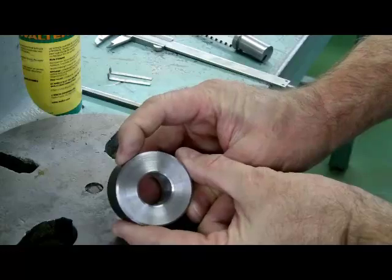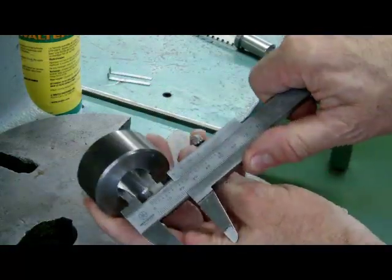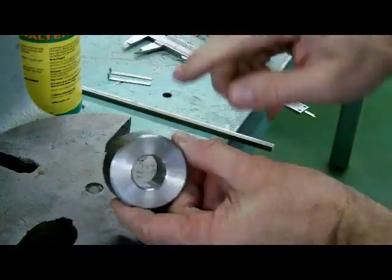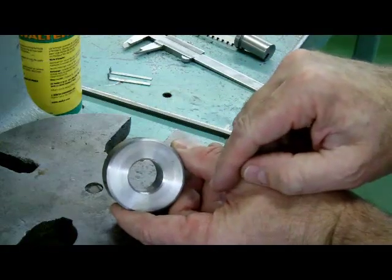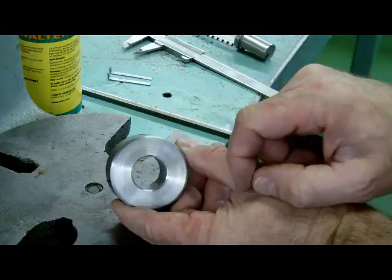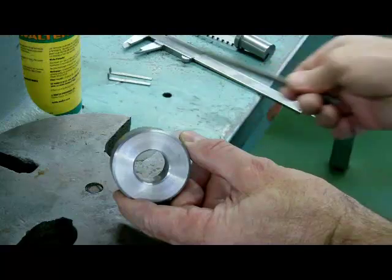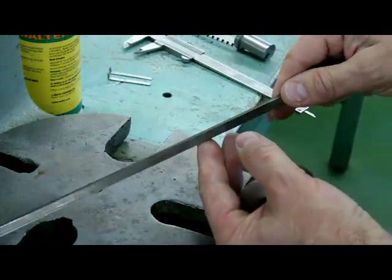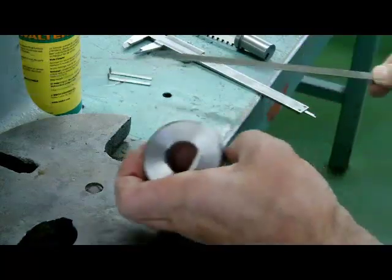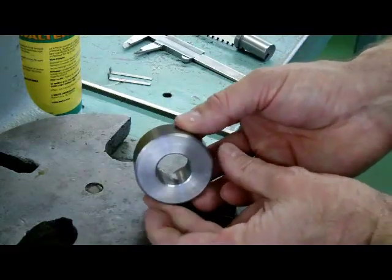This is the hub that we've machined to fit the shaft. What we've done is we've drilled and reamed this to a size — in this case it's actually 7 eighths of an inch. What we're going to do now is broach a keyway in this bore. The groove we're going to put in the bore is called a keyway; in a shaft it's called a key seat. Then what we do is we take a piece of key and put it between the shaft and the bore, so the bore — in this case a sleeve — will slide over the shaft.